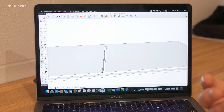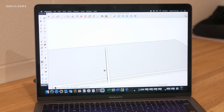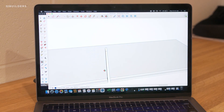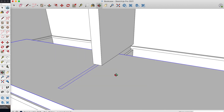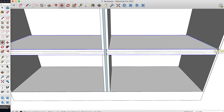The outer layers of the vertical will rest on each side so the weight carries through each vertical, down through the shelf, and into the next vertical. I'll be making these cuts prior to glue-up as well — it would be pretty tricky to cut them in once the pieces are assembled and would create a lot of extra work and dust. I do have a little bit of play and I don't want these joints so tight that aligning all the shelves is very difficult. The nice thing about all these overlapping joints is I don't have to worry about cuts being super clean and precise — I have a full three-quarter inch all the way around each piece to cover any overlap.